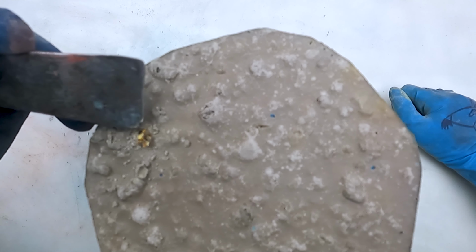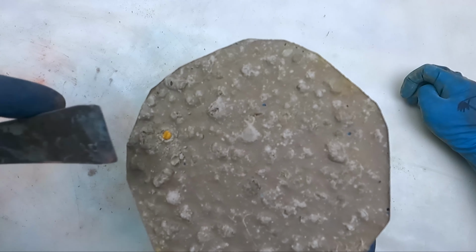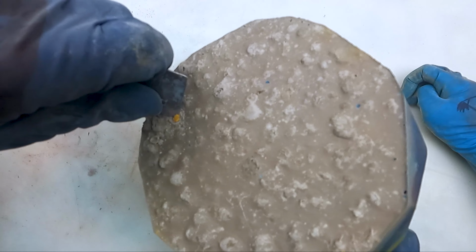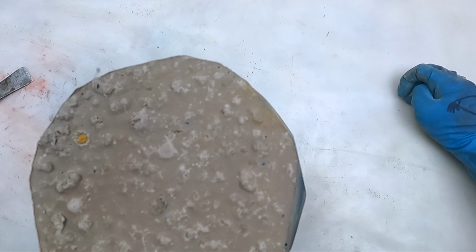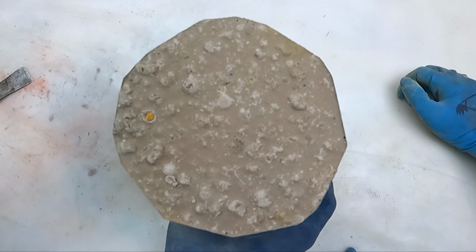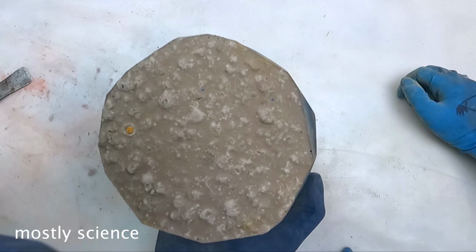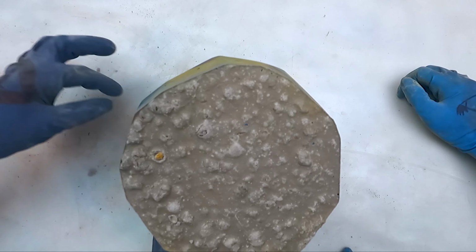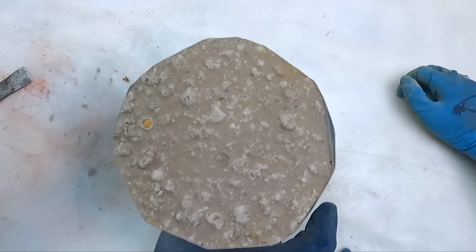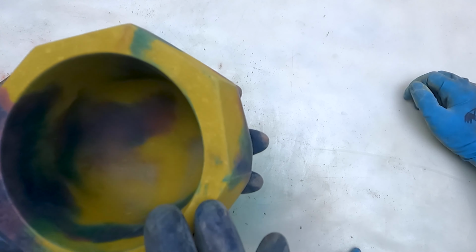We talked about having something that's inert and non-organic as your filler. Is this popcorn might absorb water and get kind of moldy and then start molding out of here? It could. That being said, concrete is super basic, meaning it's alkaline on the pH scale. It's actually pretty difficult for bacteria to grow in it. Concrete has to be very aged. A fresh mix like this, hard to get moldy. You'd have to put something pretty funky in there.